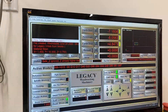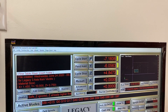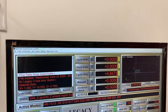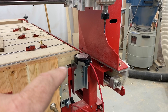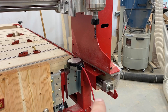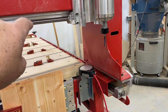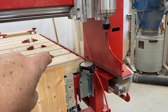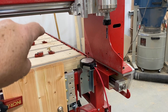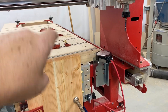That gives me a number here. I'll zero out my X and Y number. Then I took measurements to my X line. This is Y0 already — we just established Y0 and I scribed that line all the way down the table. That was Y0, then I came in 2.5 inches for the 2.5 line, and then 5.5 inches from that Y0 for the second line.